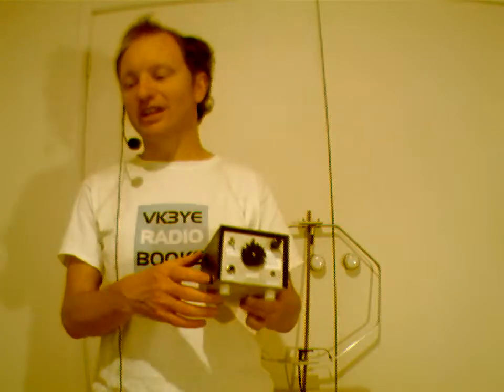I've suggested some minimum requirements, particularly for us here in Australia where we don't have the population density that other places do. You really need to be frequency agile. That's so important because most of your contacts with QRP are you finding other people, whether you're replying to them, they're calling CQ, and you want to respond to them, then you need to be able to move to their frequency. There might be a contact about to finish. Again, you'd only know about that if you can tune your equipment to their frequency and give them a call. You might also need to dodge frequencies to avoid interference. Again, you need to be frequency agile.